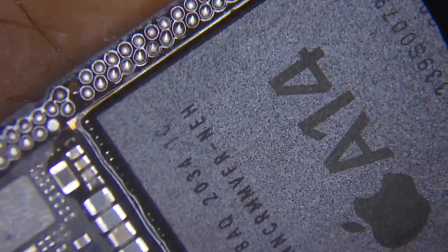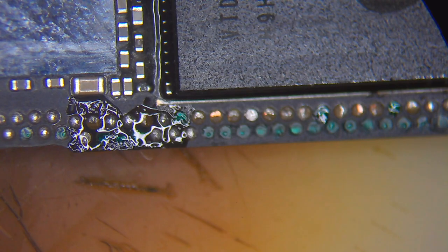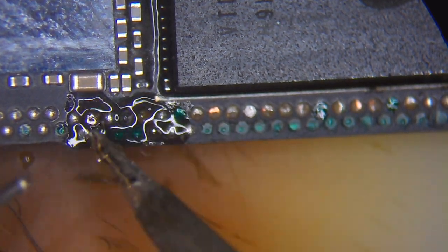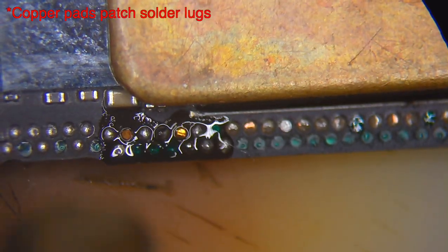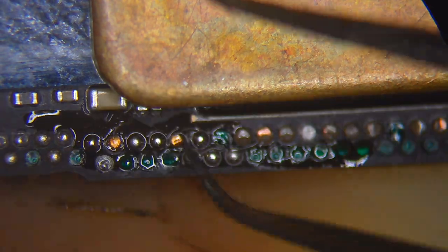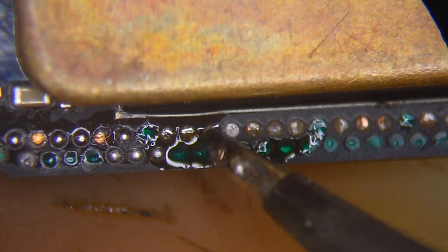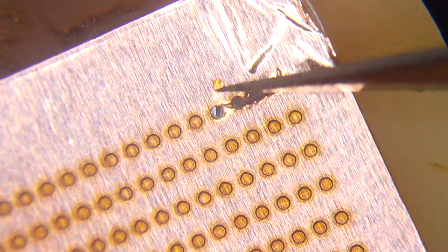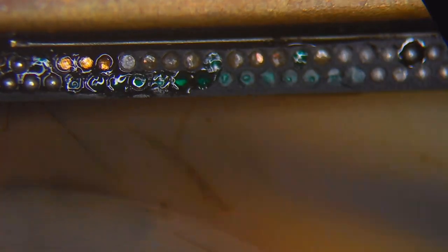I turned on the ultraviolet light to make sure the mask is dried out. Now I'll put a little solder on each root so the pad or jumper can be soldered properly. This time I'll use copper pad patches ordered from AliExpress — a link will be in the description. These copper pads are much easier and faster to solder and are very good quality, almost matching the original pad. A little soldering paste, hot air gun, and the pad is soldered very nicely to the root.